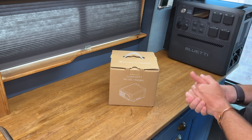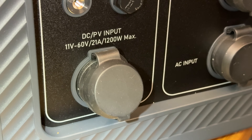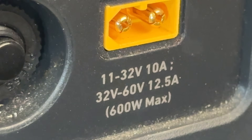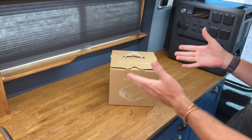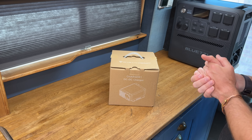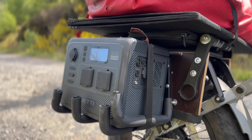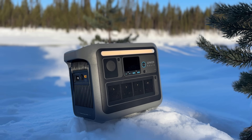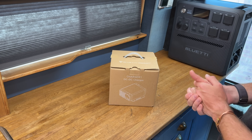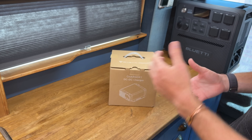This DC-DC charger uses the MPPT controller solar ports built into many power stations, which is normally used for 12-volt charging as well. You can set it to the maximum voltage for that power station on the device via the app, and then it supplies a constant voltage and amps to the MPPT controller built into the power station, which itself runs the charge profile correctly. The Bluetti Charger 1 can plug into Bluetti power stations as well as EcoFlow, Anker, and all other chargers via their 12-volt or solar ports. One difference, though: those other brands are bi-directional — this is not. This is only a charger; you can't use it in the opposite direction for charging your starter battery.